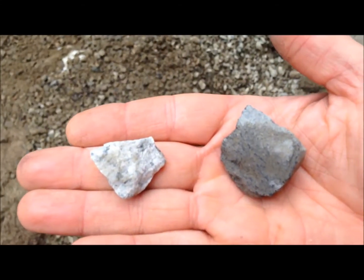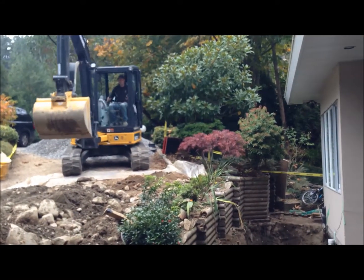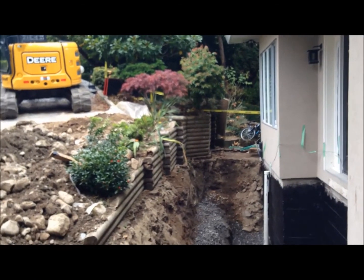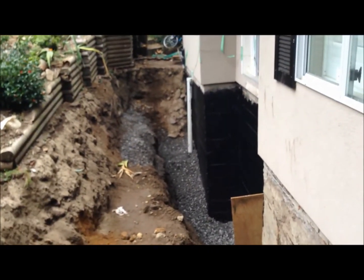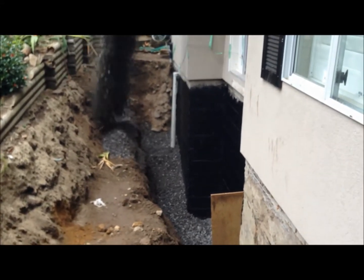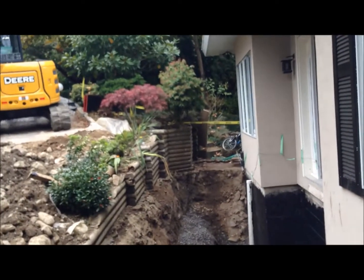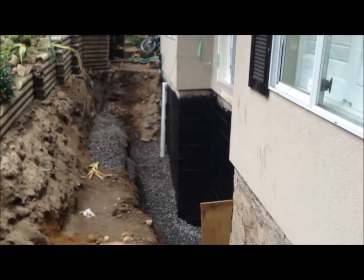This is granite on the left and basalt on the right — that's what the crush is. Wank is using his excavator now and he's going to fill up the rest of that trench. The reason he told me he doesn't start filling at the bottom is he wants to be able to lay down the landscape fabric, but also the machine causes a lot of vibration. He doesn't want to cause the topsoil bench on the far left to fall apart and undo all the work. You don't want this to cave in because he'd have to dig it all out again. So he wants to get a first run in, get it high enough so the vibration of the machine is very unlikely to cause that bench to cave in.